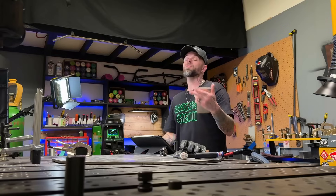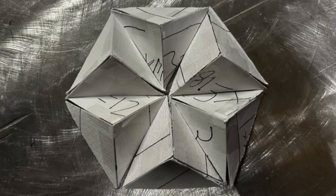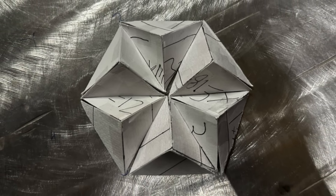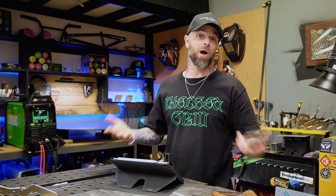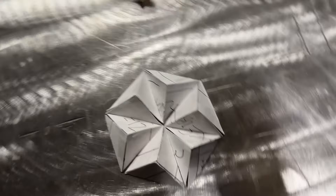Today we are talking about advanced techniques, so let's get advanced here. When I was doing projects like this back in the day doing production welding — and I did it for 20 years — my advanced aluminum thinking begins at this phase. Thinking about the joint after it's assembled would give me the hint that I would start to encounter problems with wire brushing. I would identify that this might be a challenge ahead of time before I even started putting it together. So I would actually start preparing these with my wire brush before I started assembling it.